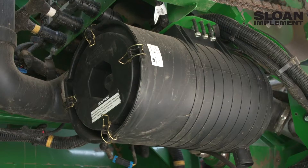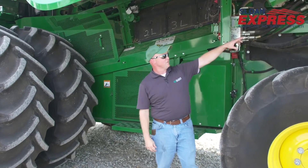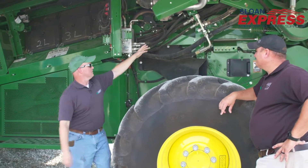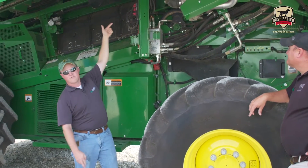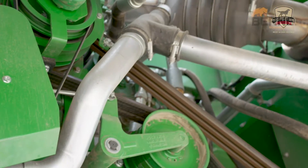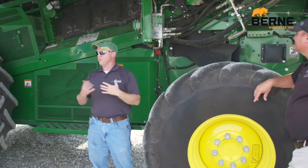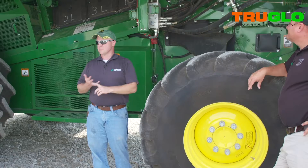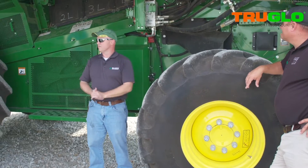There's not a lot to talk about here. This filter is for your emission system — that's all it's really there to do. All my emissions are in this rear enclosure back there, that big green box on the back. This unit — looks like a supercharger off a small block — is pulling air from that filter and blowing the air back into that enclosure for your emission system. That does two things: it puts somewhat cooled air in to keep it cool, because those things have a tendency to get very warm, and it pressurizes it, which helps keep dirt and dust out so there's no chance of a thermal event.